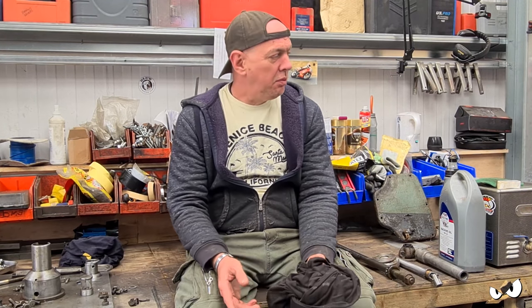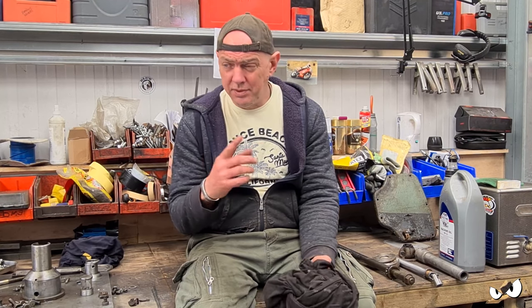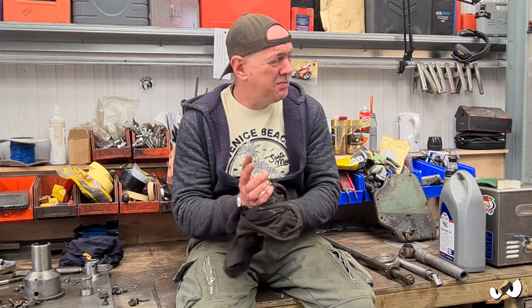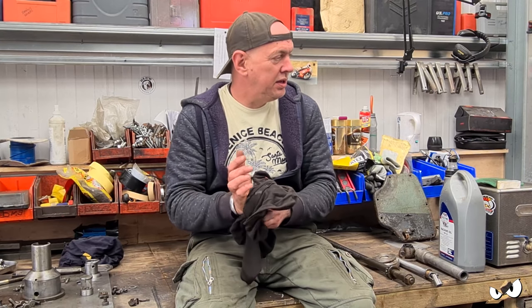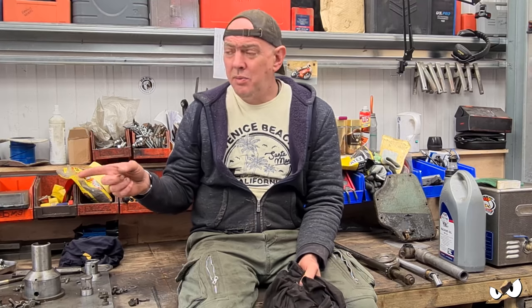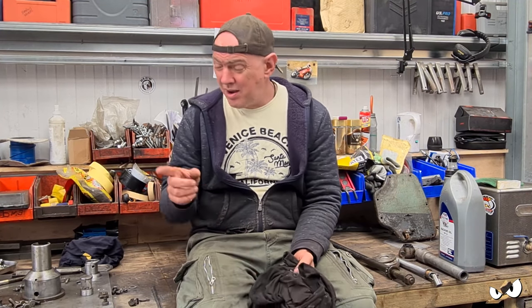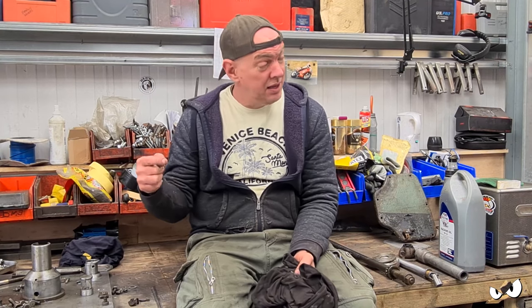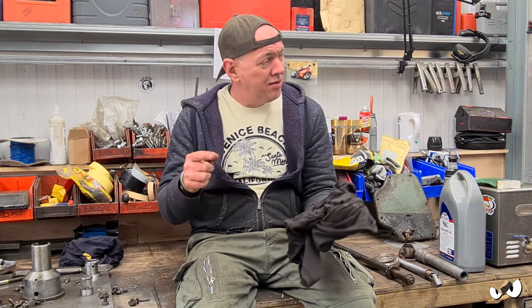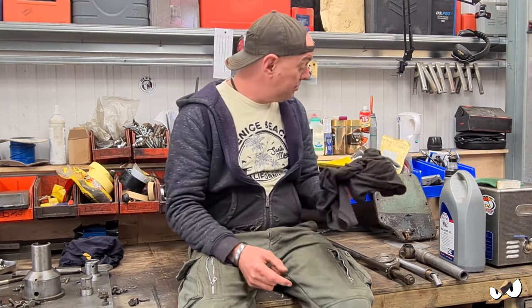So that's it. So anyway, what's the plan? Well, like I say, I'm off today, but I am working tomorrow, but I can come in the morning, so that'll be all right. All this lot should be dried, so that way I can stick the handle back on for the knee, and I can set my gibs up for that. I can shove the lead screw in for the Y travel, and I can set the gibs up for that as well. I might even get the bed on and put the main lead screw in.